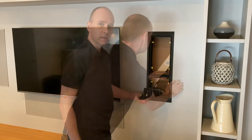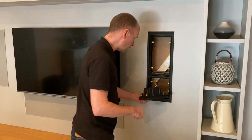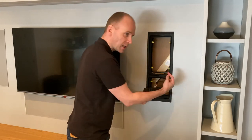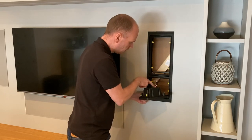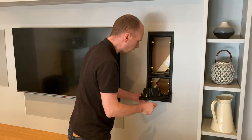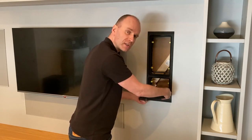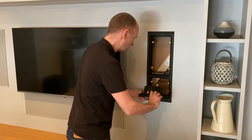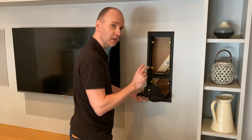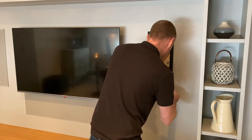That's our framing. Okay, we're just going to finish the toolless installation here. So I've got the speaker cable from the AVR coming into the tweeter module, and then a link piece of speaker cable going up. And of course, again, with that switch on the back of the module, it's now set to 1W because we're only connecting it to one woofer module, whereas with the center speaker, it was on 2W. So I'm going to pop this in now.